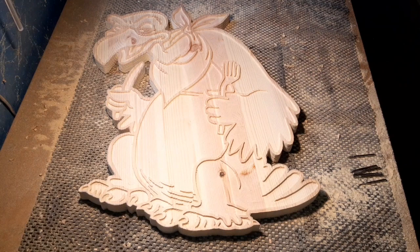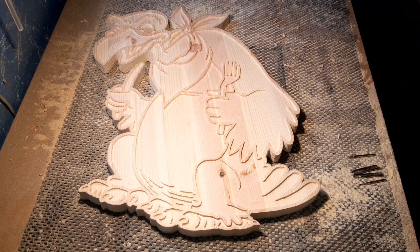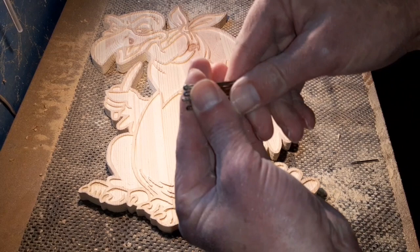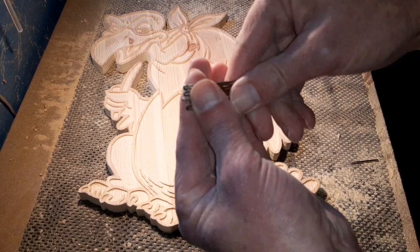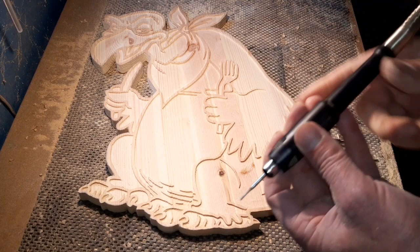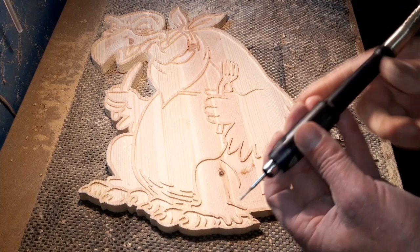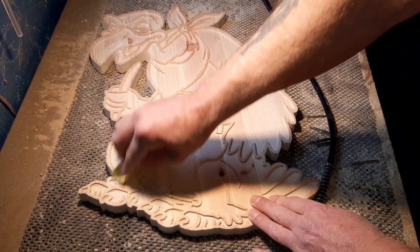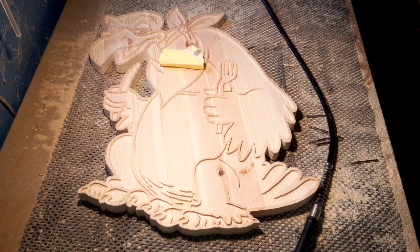For the next stage, simply give it a general tidy up. I'm going to go around these edges and do away with those little pencil lines. I like to use these cheap engraving bits — if you go on eBay or Amazon and put in dremel engraving bits, you'll find these non-Dremel bits that work fine. Find one with a nice little flat bottom that attaches to a cheap flexi cable, which attaches to the end of my Dremel. That lets us get into the really tight areas all the way around. Then we'll use sandpaper to round off those edges, get rid of pencil marks, come back with the mouse sander for a nice general tidy up, and then we'll look into the finish before putting the resin in.